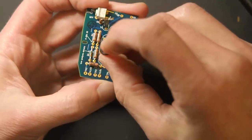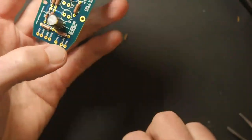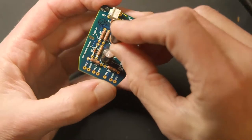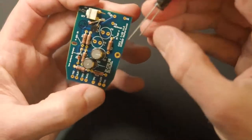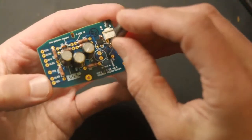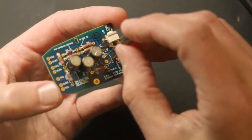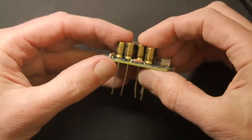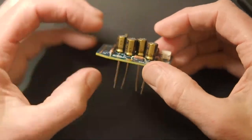And on this circuit board, I've actually put some help text right on the board too about how those go. And there's also a photo in the manual. And I laid out the board so that all of these would show the stripe in the same direction. I try to do that in a lot of kits. Sometimes you can't because it makes leads either really difficult to route or something. But in this case, when it's all right, you'll see the gold stripes all in the same place. And you can see that in the book as well, right there.